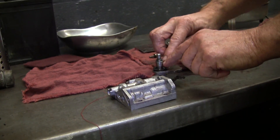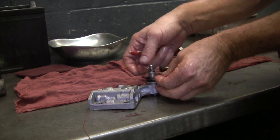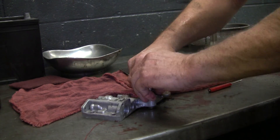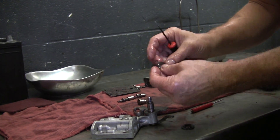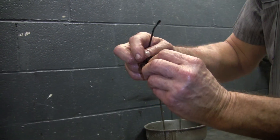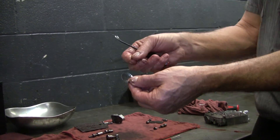A common source of leaks out the side — remember that housing cover went over here, so you've got a seal around here plus a shaft here. There's usually a cork or an O-ring in here. You pull out this pin and there's no ring here. This one is a kind of primitive lip seal and it was installed backwards. The flat part is supposed to go against the housing; the lip is supposed to seal against this shaft.